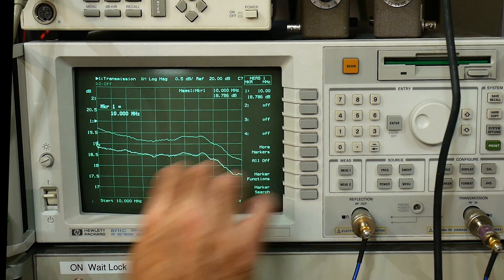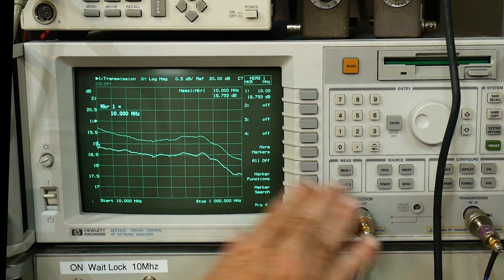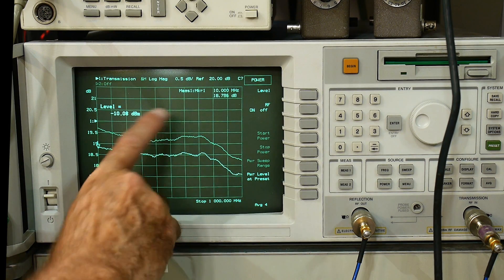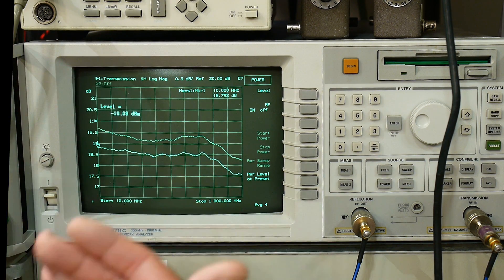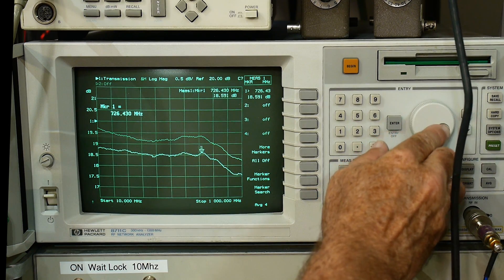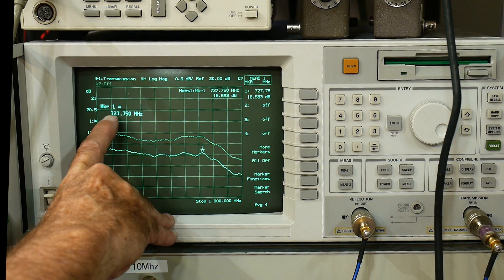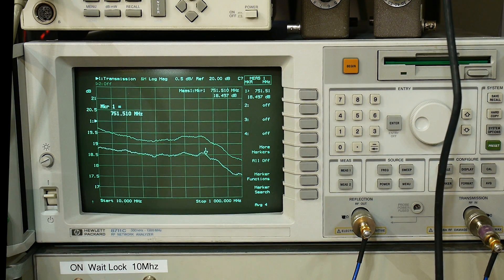Let's run through that again. Our gain is 18.7 — we've measured it. The gain is 18.7, and we are inputting minus 10 dBm. Add those two together and that gives you plus 8. So the 1 dB compression point is plus 8 dBm, and that's how this amplifier would be specified. The gain is fairly constant out to a point, then it starts to roll off. We could use our marker to determine the usable frequency — we'd call this amplifier usable to about 727 megahertz, or call it 750 megahertz. It has a 1 dB compression point of 8 dBm.